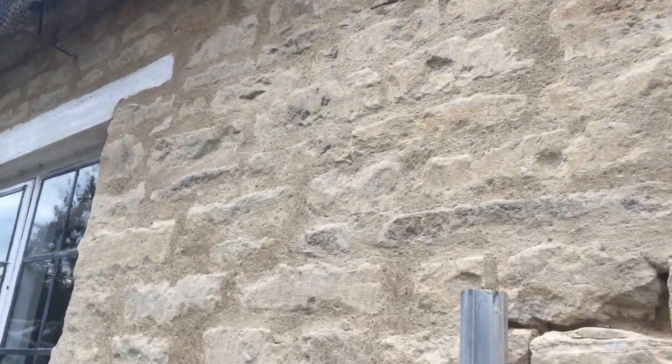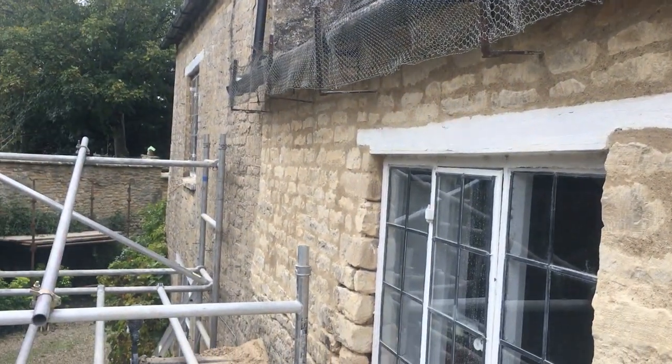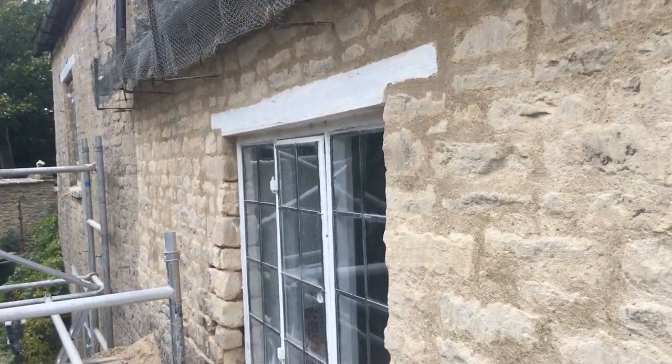This is something that's in the process of drying out. This new mortar has some limestone chippings in it. You've got to keep misting it to allow it to carbonate — otherwise it dries out too quickly and doesn't carbonate.